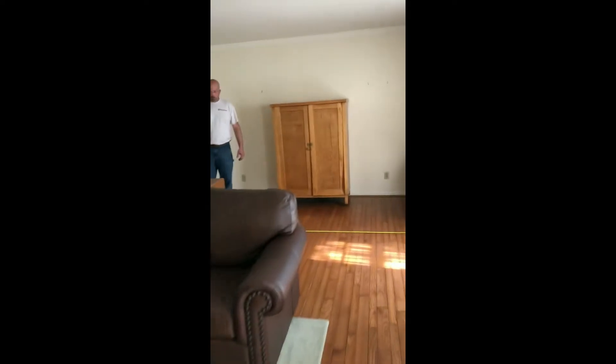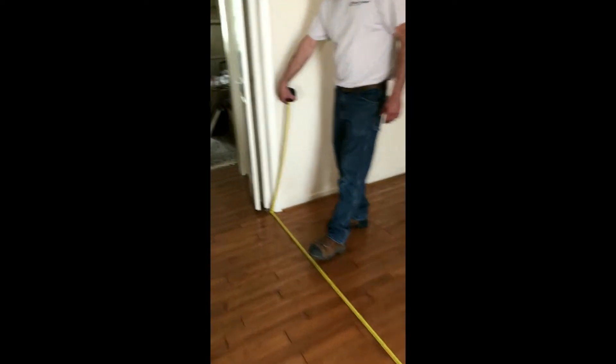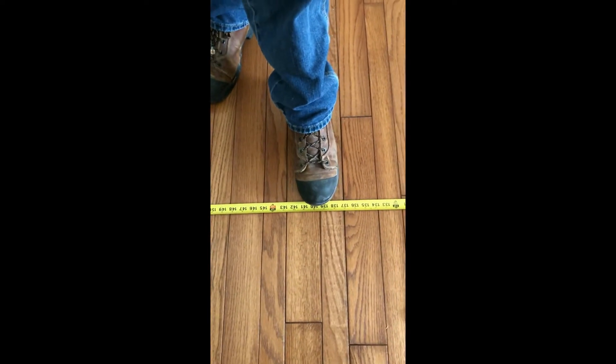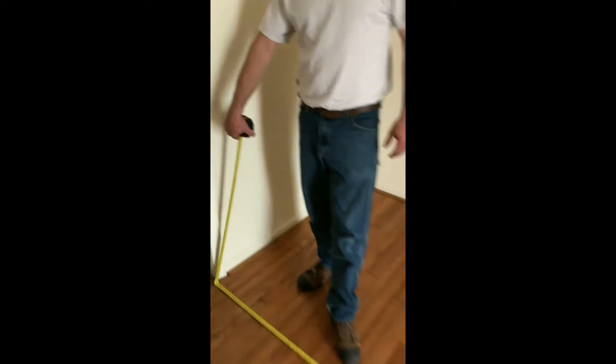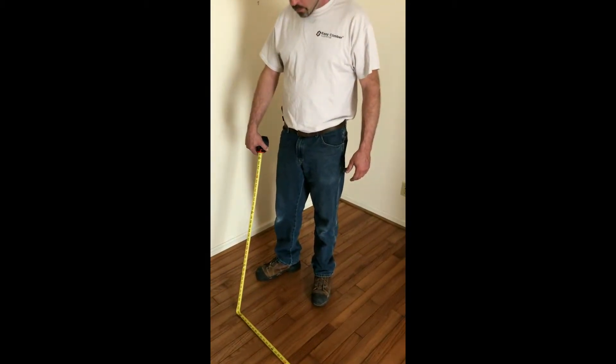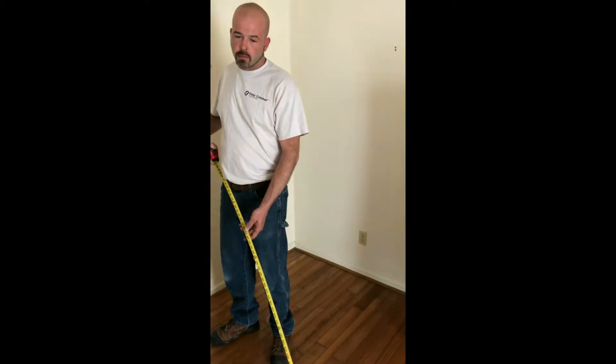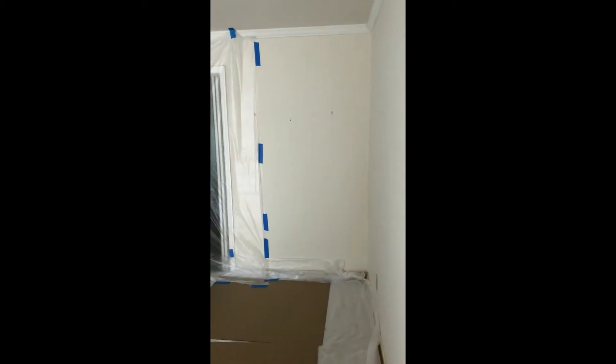From that exterior wall, our measurement is right about 140 and a half inches. Going back downstairs to cross-check with Kenny: upstairs was 140 and a half to the inside of the drywall, measuring off that same common exterior front wall. Downstairs we're at just about 14 feet, so we're about two feet three inches off. We now know we have to keep the elevator out of that corner at least 27 inches, probably a little more for space between the wall. That's the basic process to verify our measurements.